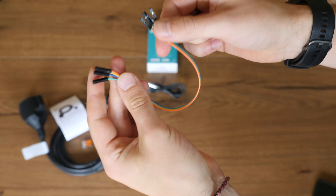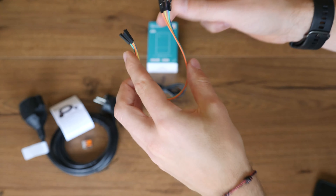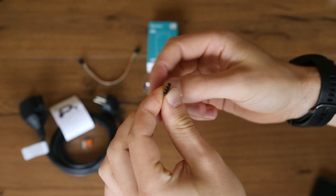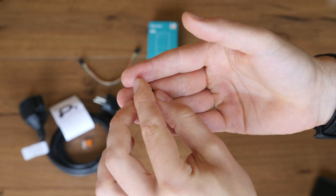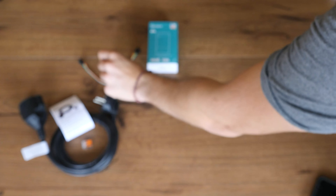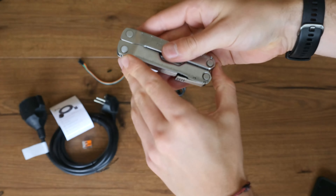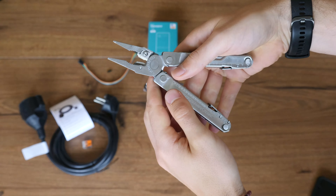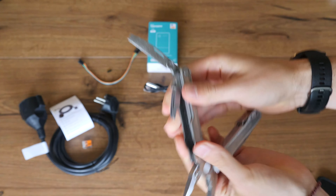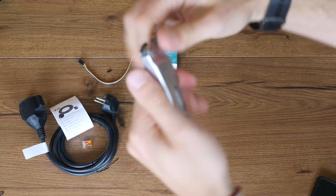Connection to the ESP32 chip on the TH Origin's PCB is established using a rainbow cable with four wires and female connections on both sides. To attach that to the PCB we'll also need a 4x1 pin header. A Leatherman will come in handy — we'll use it as pliers to snap the Wi-Fi antenna cable back into place and as a file to make space to route our rainbow cable to the outside of the housing.